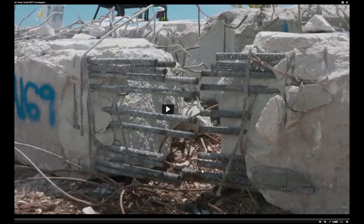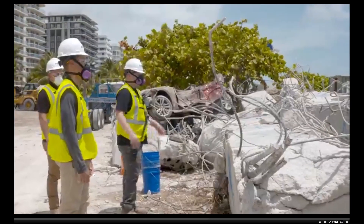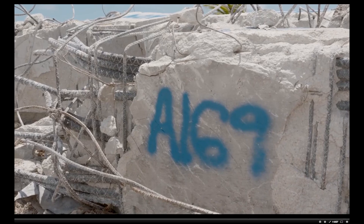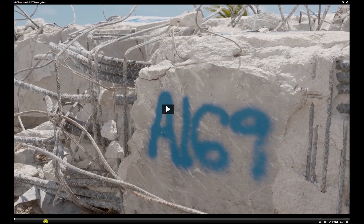Looking at this picture, we don't know if these are too close together, but I'm assuming they are. You really want to have one inch in between these rebars for the concrete to flow properly. Now here's another twist — these down here look pretty close, these here are pretty close, and look at these: I believe there are one, two, three, four of them right here — almost touching. That's a no-no.